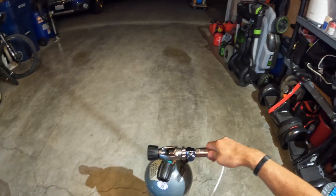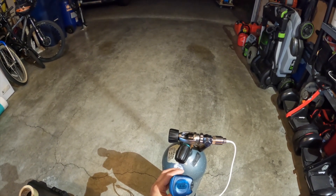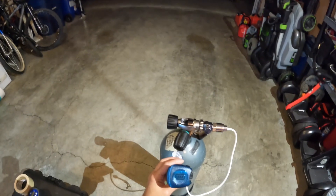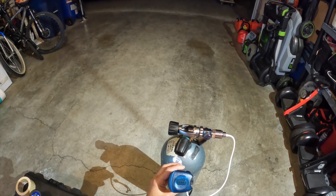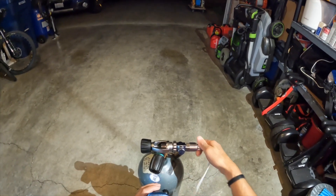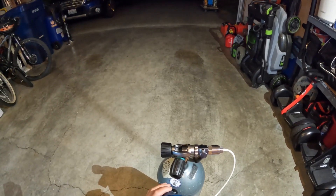We connect this here and when we crack the valve, gas will start to flow. Looking at the display — our numbers are going up consistently: 31, 32, 32.5, and climbing through 33.0, 33.1, 33.2, 33.3, 33.4, and it's settled at 33.5. Very consistently settling at 33.5. If we push the button on the side, it goes into hold position. We can turn off the gas. We've had a very consistent sampling rate at 0.2 liters per minute over that period of time, and the confirmed reading is 33.5%.